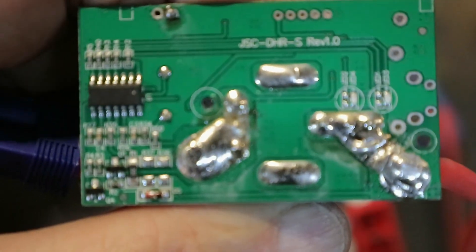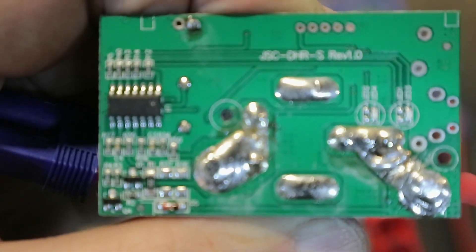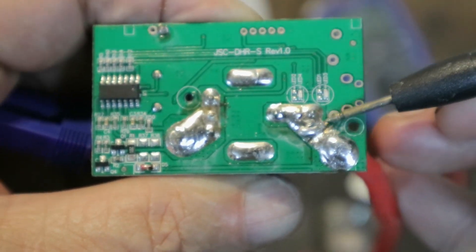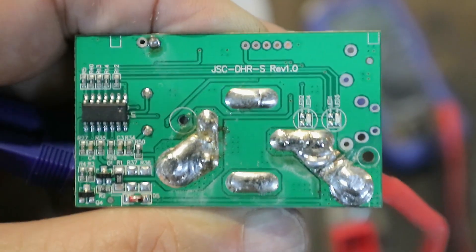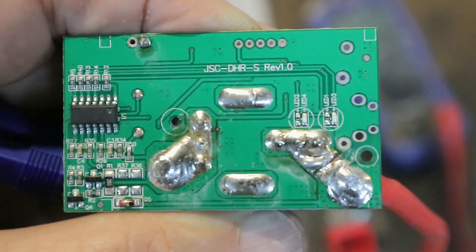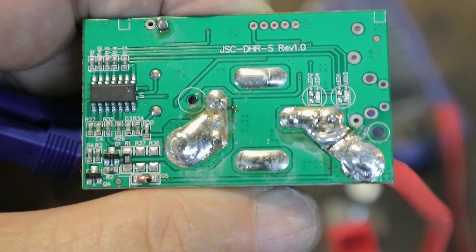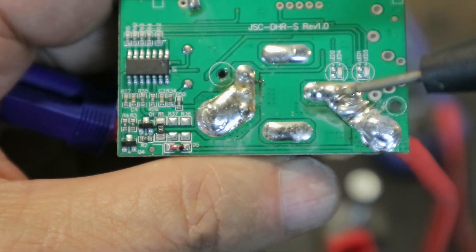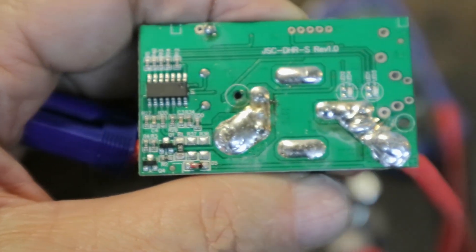Let me get a better look at this. Right here, it looks like they intended that to be soldered together, and somehow that solder joint got broken. It's hard to tell whether they soldered it by accident and then tried to saw through it, or whether it's supposed to be soldered and isn't. But I know that if I have my 16 volts here but not there, that's the problem. I'm going to check that one more time and if that's what it turns out to be, I'm going to go ahead and solder it and see what happens.